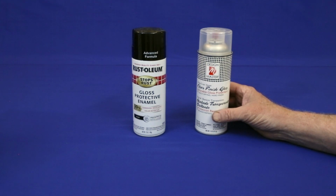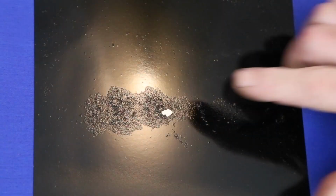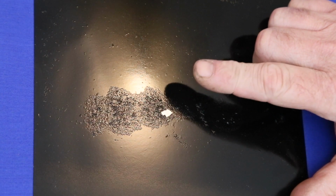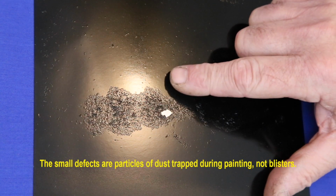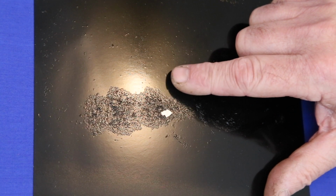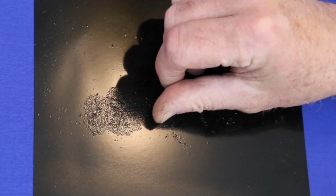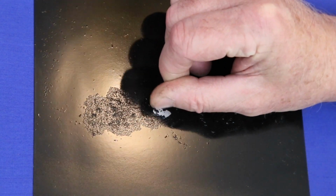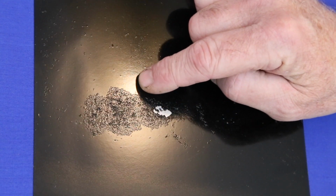But from time to time this clear coat will attack the paint, causing it to blister. Here's an example. The frustrating thing about this is that it's erratic. Half a dozen pieces will come out perfect, yet the next will blister. This inconsistency can be seen in this example. While the center is heavily blistered and the paint has gotten so loose it can be scratched up easily, the surrounding area is really quite fine.